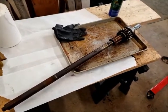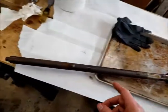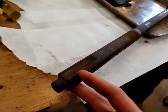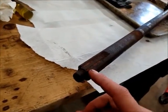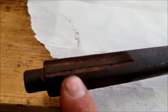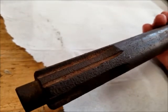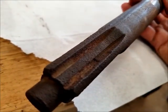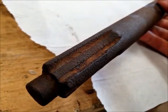I'm going to change gears here — pun intended. I want to work on this shaft and get it cleaned up because the main shaft is what the clutch runs on at this spline here. I don't want to put the transmission all back together and then run into issues with this spline, because you can see there is some significant wear in the center portion of the spline where it was riding. I don't know if it's enough to be concerned about but it has caught my attention, and now is obviously the time to address it while the shaft is out.